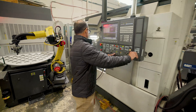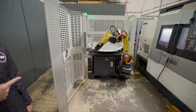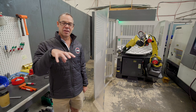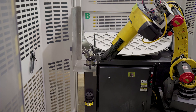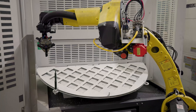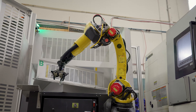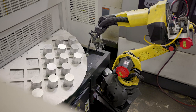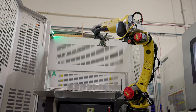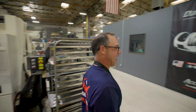What I'm going to do now is close it up and let the machine progress to the next operation. Since this robot is intelligent, it's checking its gripper to make sure that the pins are set for the right bar size. One side of the gripper grabs the bar stock and the other side grabs the actual finished part. The robot knows there are no parts on this side and knows there are parts on the back side, so it's going to move it. It's a big advantage over the old technology — it has some type of intelligence to know the difference between one part and another part. And it does. She's always there for you. Every day I come to work, she's there.